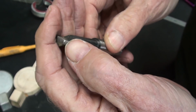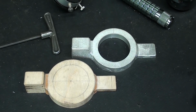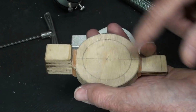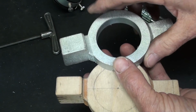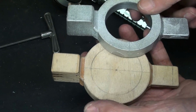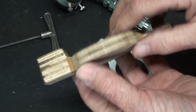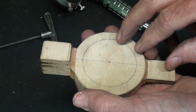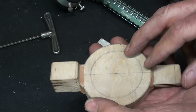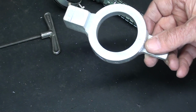A little bit loaded. I did not use any lubricant, as you noted. And I know there will be some of you that are saying, well, why didn't you make your pattern so that most of the hole was already produced? In other words, cast in, and then you can just clean it up with a boring bar. Well, that's one more step in difficulty in making a pattern. And remember, that hole would have to be tapered so it would withdraw from the sand. So to me, it was easier to remove it in one fell swoop with that hole saw, which was no big deal.